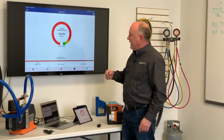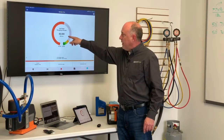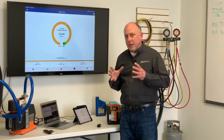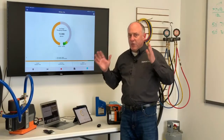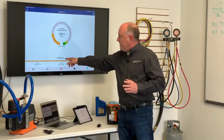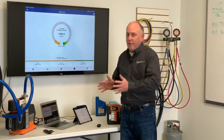In a few seconds here, now remember we're at 760,000. Now we're just down to 120,000 microns, 48,000 microns, 29, 25. Now remember I told you before, all that traffic, 760,000 microns, we had a huge amount of air density, and how it was only going to take a few seconds. We're at 30 seconds in, we're already at 6,000 microns. So those quarter-inch ports, they aren't even a factor, right?